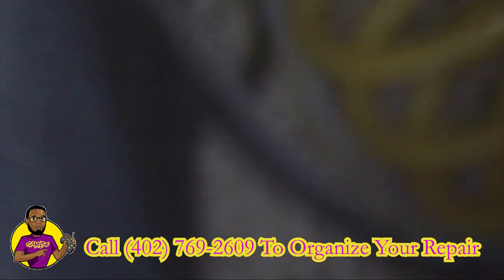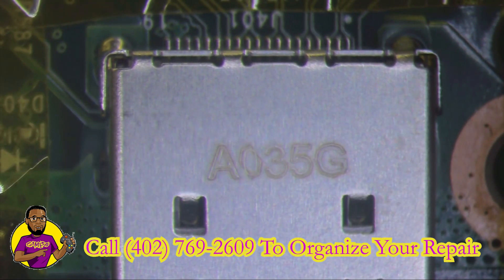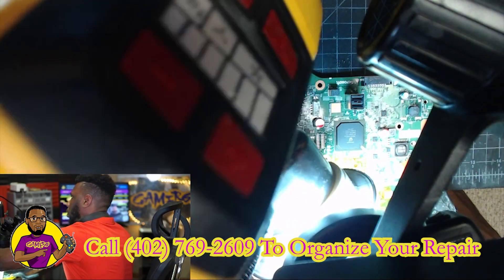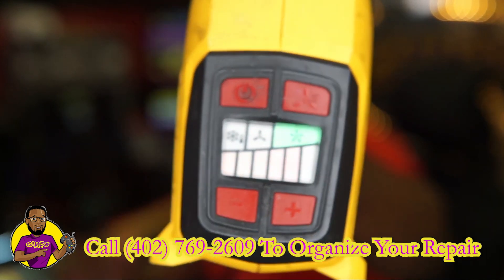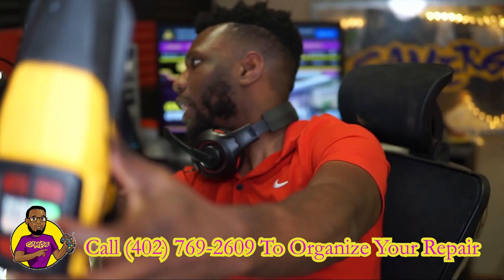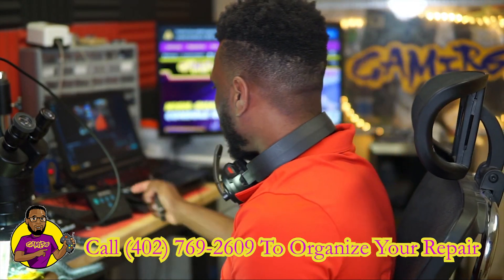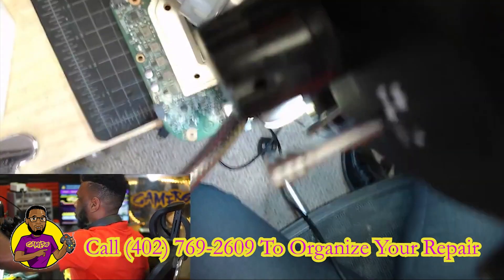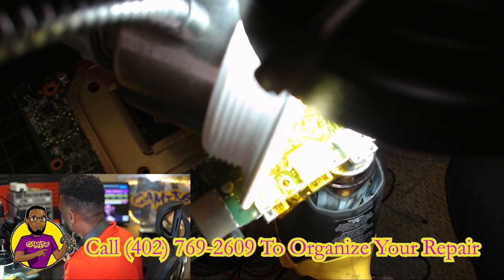Now I'm going to switch over to the microscope so we can see over top. As you can see, we have our HDMI port right here. I'm going to go ahead and take my heat gun — I'll switch over to my upper cam so you guys can see what type of heat gun I'm using. I've got the fan on high and I'm on the second-to-highest bar. I'm going to take some tweezers — these are Husky tweezers — set them like this, heat up underneath until the solder melts and we can get it off.